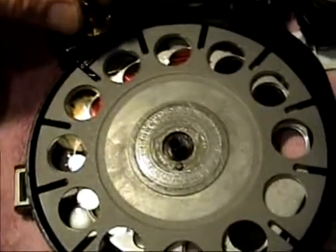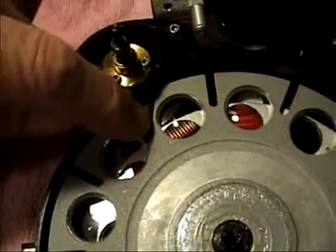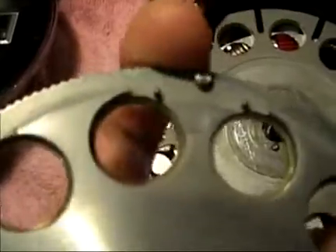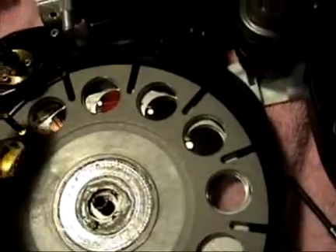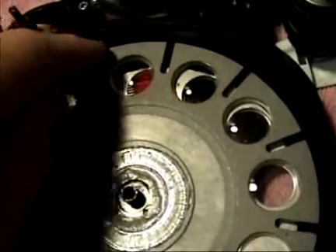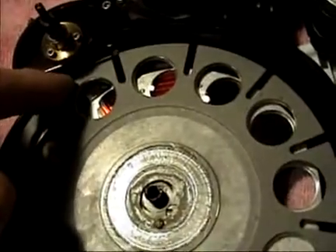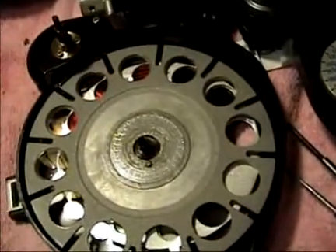The way the Phoropter is designed is that the little tips of this mechanism interact with the pin and the two little pegs on the back of this wheel. Every time this wheel goes around 360 degrees, it picks up the edge and moves the underlying wheel forward by one increment — the same thing happens each rotation. When you go in the opposite direction, just the opposite happens. The device automatically moves forward in quarter unit increments by combining the lens powers of the two power lens wheels.